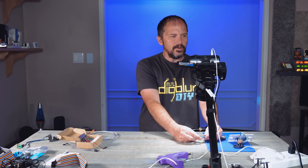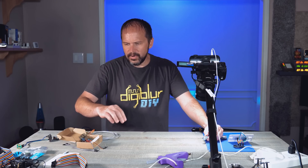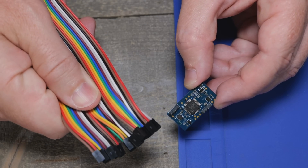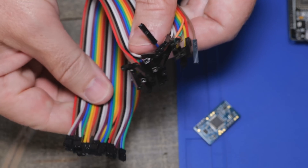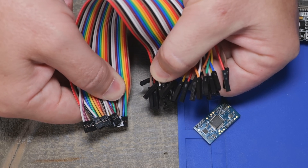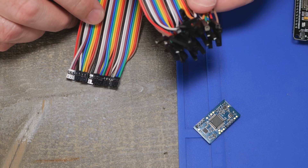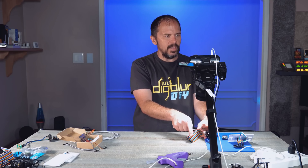The only thing that's a little weird about the LD1125 is the pins on the back. You need smaller — I think two millimeter — DuPont jumper ends. They do make these pre-made, but you can see the size difference is quite noticeable compared to regular DuPont jumpers. Just make sure you get the right smaller jumpers for this sensor versus the regular style.